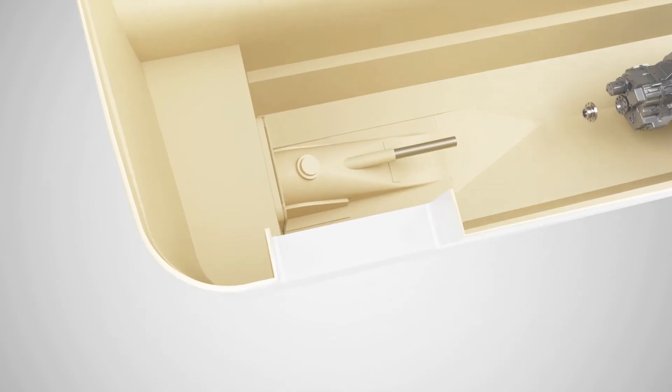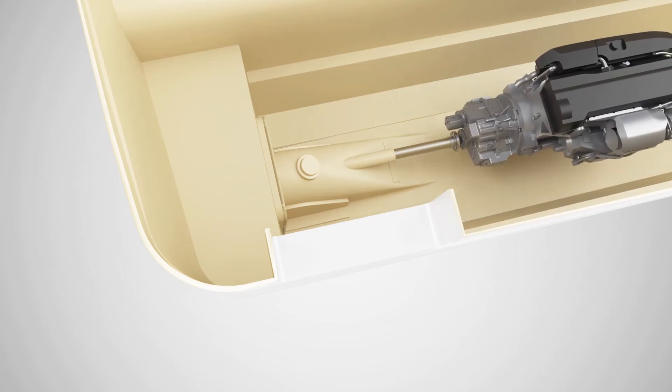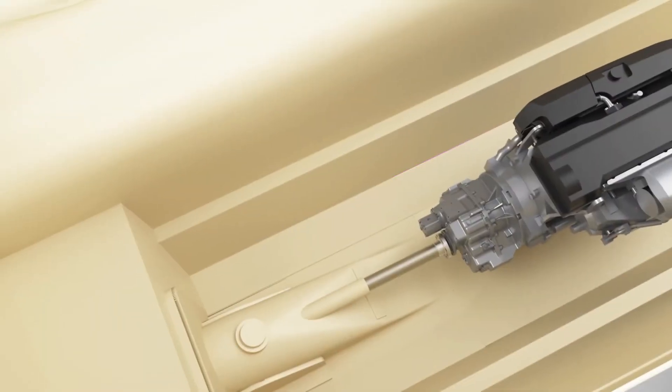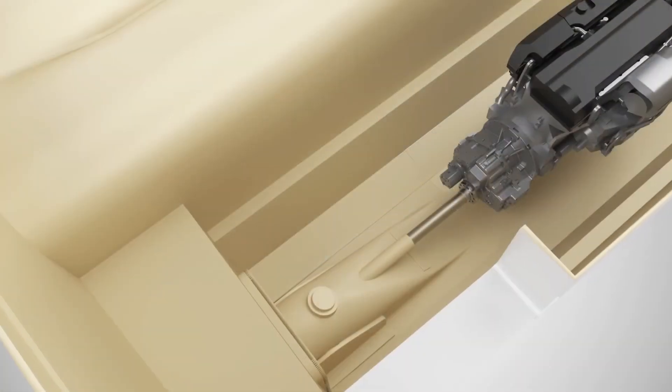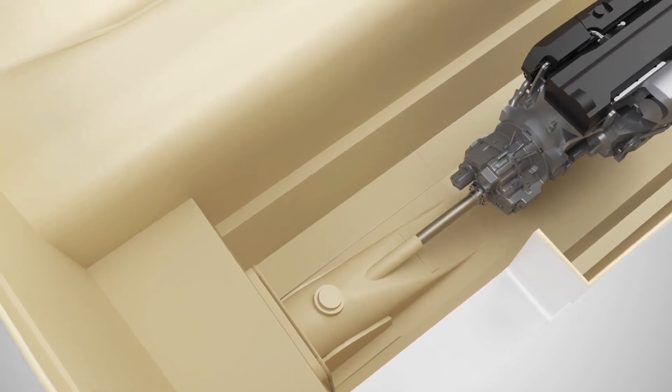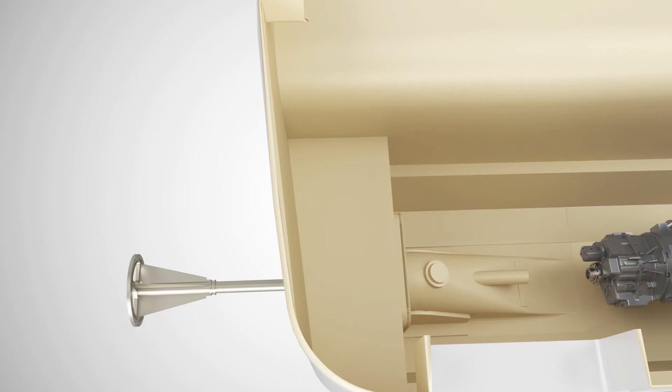The alignment tool simply bolts to the main flange of the transition piece. This same alignment tool provides for the accurate installation of the stern tube into the fiberglass intake duct in the hull. Once completed, the alignment tool is removed and final assembly of the water jet can be completed.